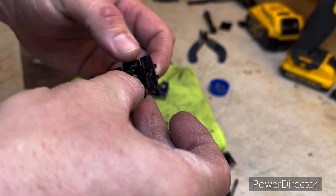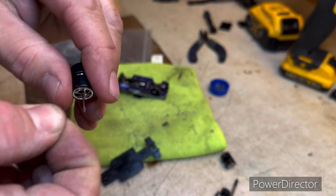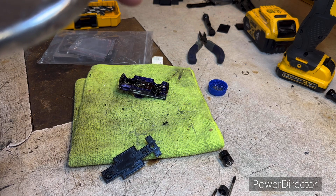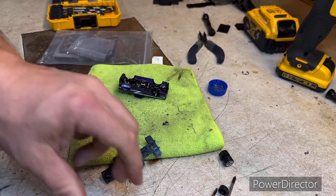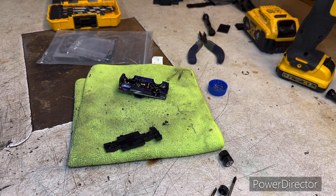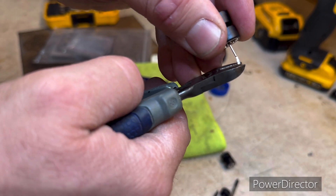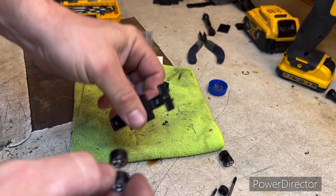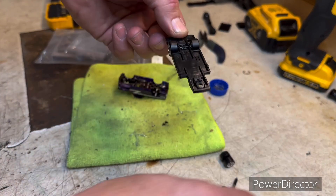Now we've got a big old flat spot sticking up there. Let's try it now. Just a little bit more — I'm going to do it one more time then we'll cut that extra off. Measure once, measure twice, measure three times, test fit it. That'll be good, we can live with that. Give that a good mashing down because we're fixing to cut that excess right there — all that extra off of it. Good solid crimp — I tightened the vice grips up one more time. Now all this extra piece, you want to leave some of it because that's what's going to hold the wheel on.